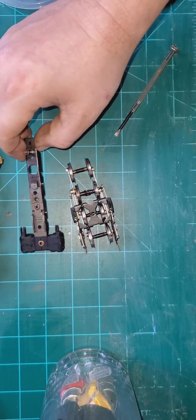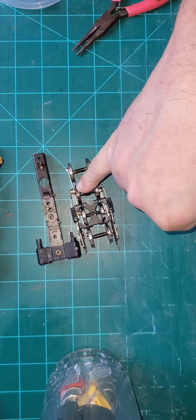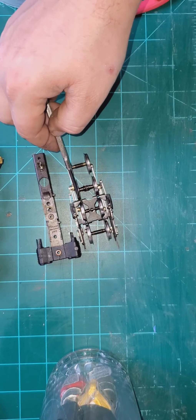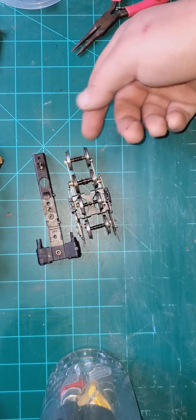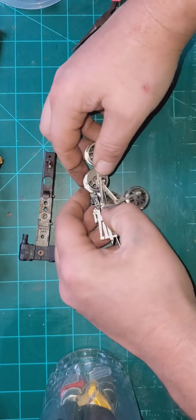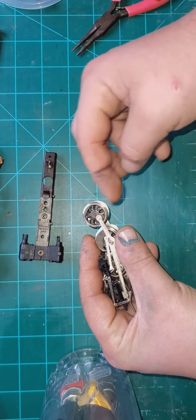I've yet to find actual brushes. And look at there - a second drive band! I thought it only had the one but it has two. I'm going to take these apart one by one, clean them, put them back one by one. Another thing I need to check - the quartering on these wheels. I believe they're out of quarter.